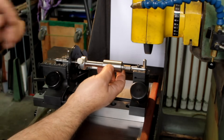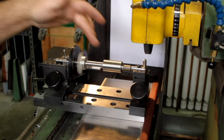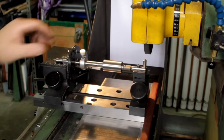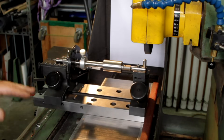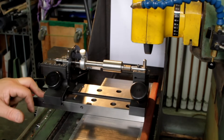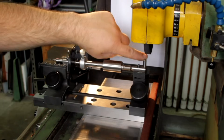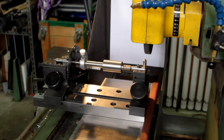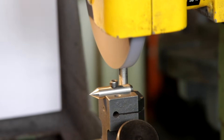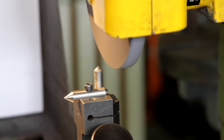I'm going to get some lube and lube these points - some high-pressure lube. Since it's plugged in now, it's got a little motor and it just turns the part, then we traverse across and grind that surface. It's pretty straightforward. You can actually make one of these - Robin Renzetti made a real nice one. This just happens to be a commercial unit. We have a diamond up here and we're going to dress the wheel. So we're dressing the wheel here - this is the last couple of passes. That's pretty good.